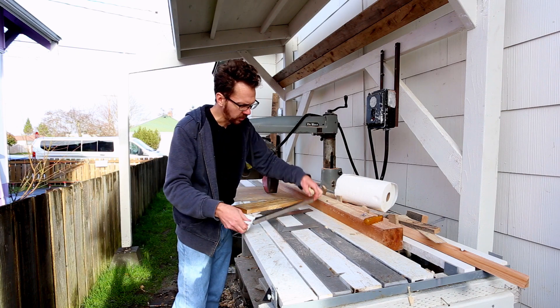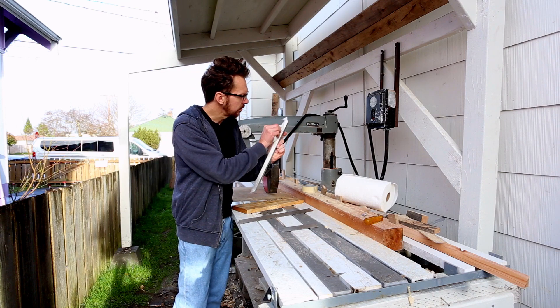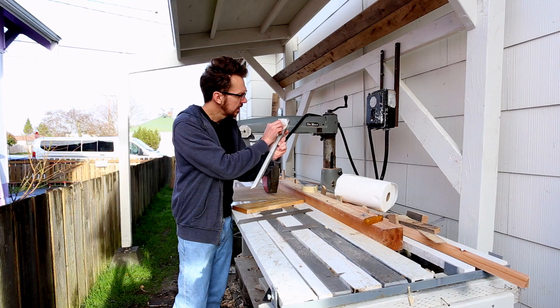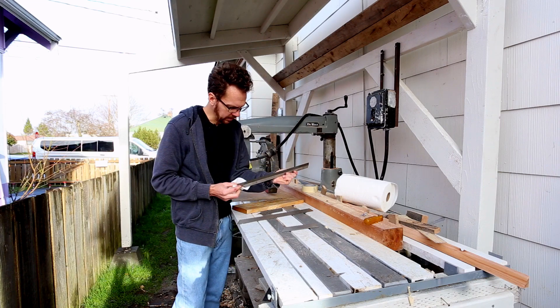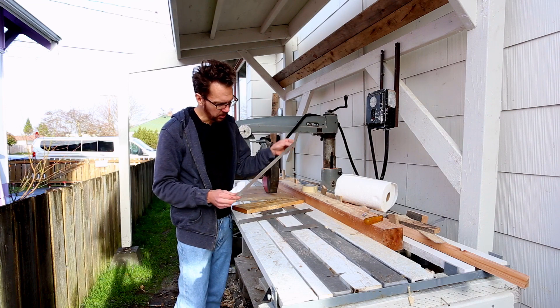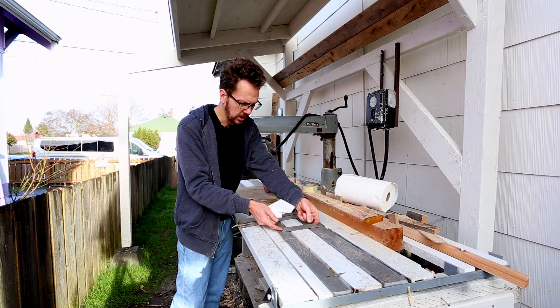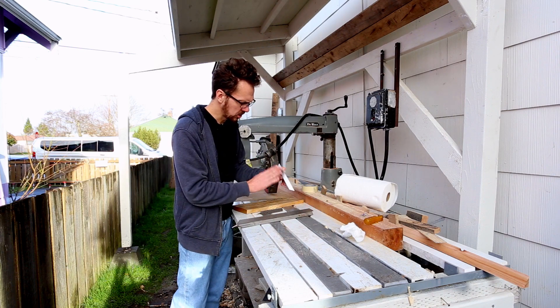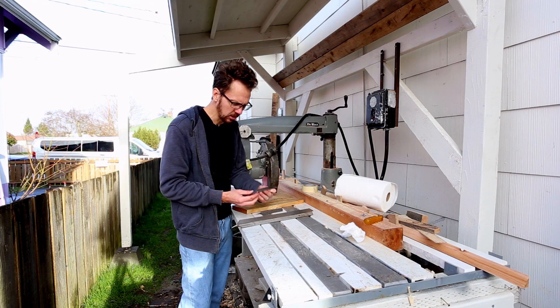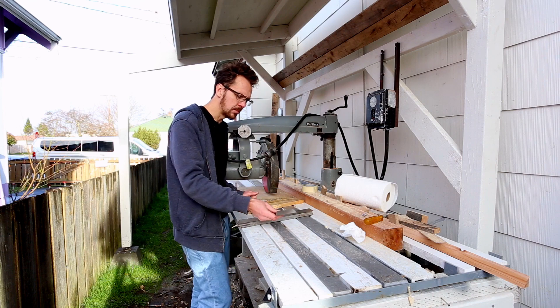To get this finish on here, I sanded it with 80 grit sandpaper. I actually used a belt grinder to make it go a little bit faster. That gets a smooth finish where the underside is kind of dull originally, because this was just plain stainless steel with no finish. So now that gets that kind of brushed nickel look to it. I think that looks good — it's time to put it together.